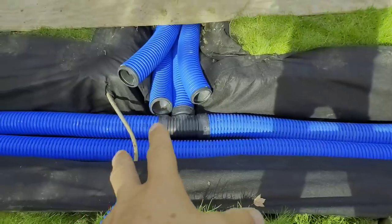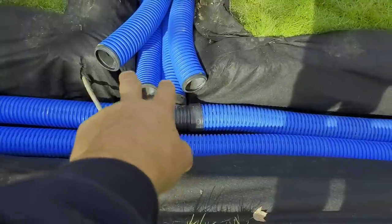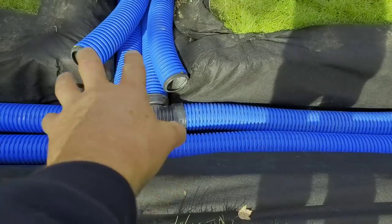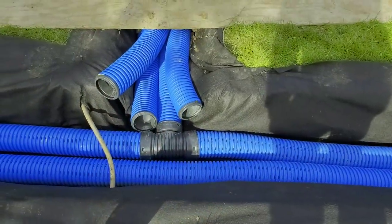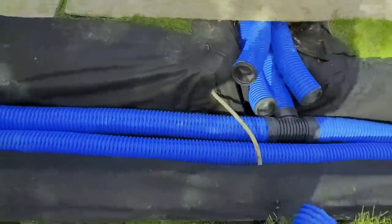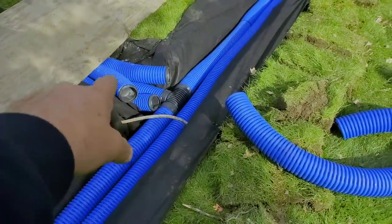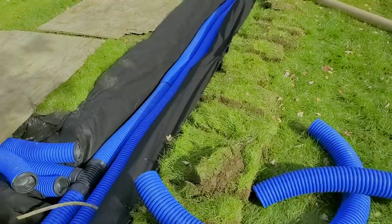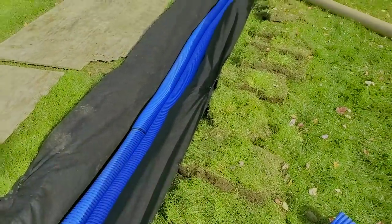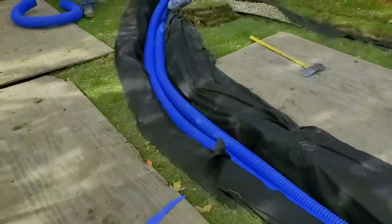Great — I'm glad I caught that. The sprinkler line over here is mended. Got a quad once tied in with the T, three end plugs — that's it. Water's going to move right through it. We didn't want to lose the reservoir to stone filling the end of the pipe, and that's why we like the end plugs. There's an internal coupler — that's why those are so handy. We keep many of those on the truck and tool trailer.